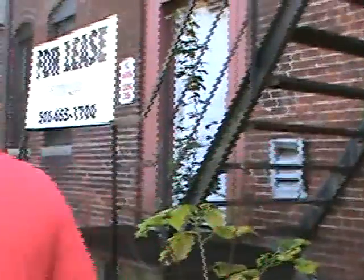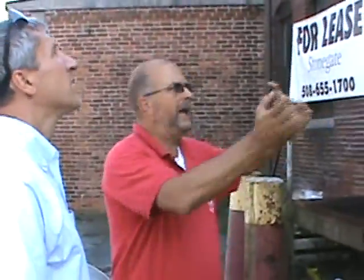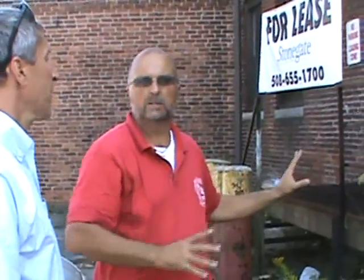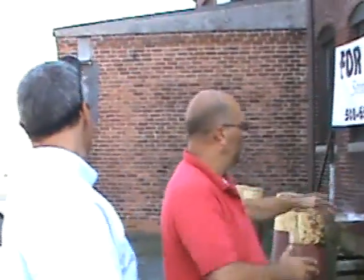These are the kind of things, because very few of these fire escapes are whipped into a shape like this one. This is kind of brought together, and some guy had pieces, and he created this fire escape system. Most fire escapes, believe it or not, are built to standard, built to code. Every now and then there's one that's shoehorned in, and this is one of those. But all you have to worry about is, do they know what to look for? Do they know what to expect? How do you deal with a welded fire escape versus a bolted fire escape? And all the codes associated.